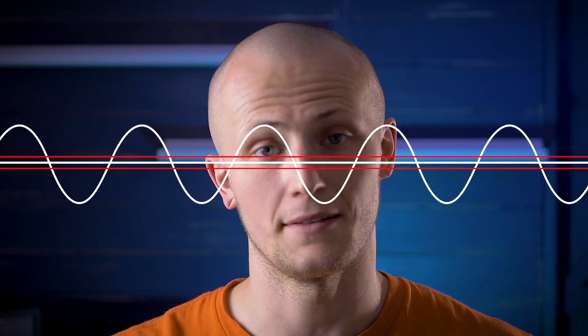There are typically three types of diodes commonly used in guitar pedals for clipping: germanium diodes, silicon diodes, and LEDs. You can also use other components like transistors and MOSFETs configured as clipping diodes. Germaniums have the lowest forward voltage, typically around 0.3V. Silicons vary widely but are around 0.7V, and a typical red LED can be somewhere around 1.5 to 2V. Imagine a clean sine wave with diode threshold lines at those voltages — the red LED clips highest, germanium clips lowest.